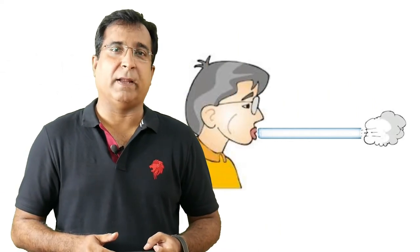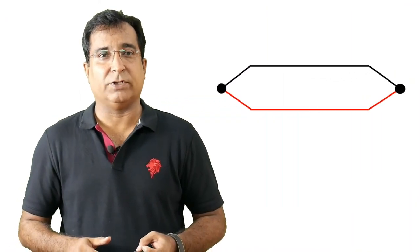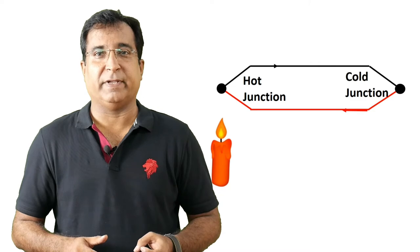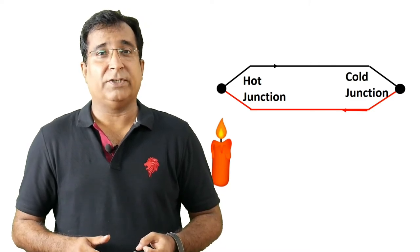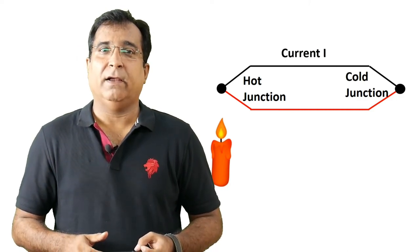This experiment is very much similar to a hollow tube having equal pressure on both ends — as soon as we apply a blow with pressure, air flow takes place, directly proportional to the pressure difference created. The same way, electrons start flowing from the hot to cold end junction. This is called the Seebeck effect in physics. Now electrons move more freely in some materials than others depending on their properties. So when you connect two different metal wires, like iron and copper, in a loop by joining their endpoints making the cold junction — at first there will be no flow of electrons as both junctions are at the same ambient temperature. But if one junction is exposed to heat, electrons will diffuse from one metal to the other, thereby making a current flow.